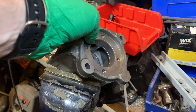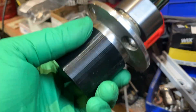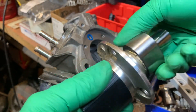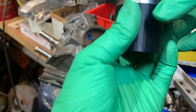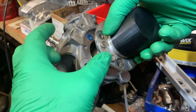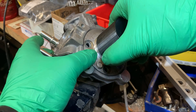First we need to put a new O-ring onto the face of the body so that when we mount the front bearing plate and shaft we get a seal around this passage. A little bit of oil on the rear part of the shaft as well as the lobe that the roller rides on. I didn't have a torque spec for the front bolts so I've gone with about 60 inch pounds, which seems right for that size of fastener.